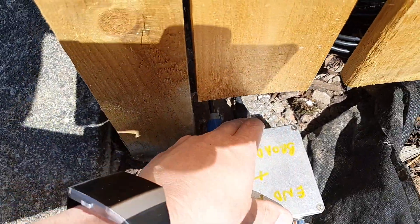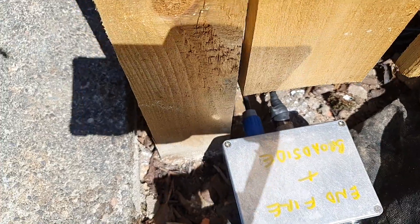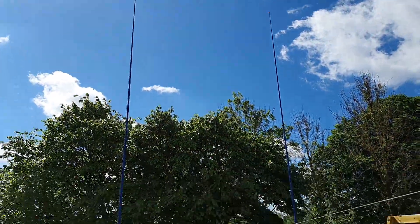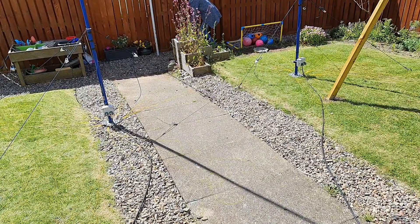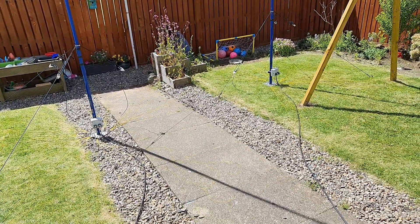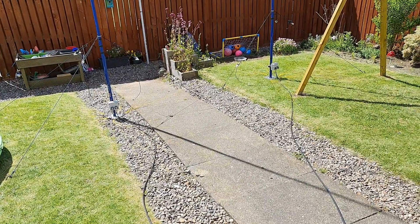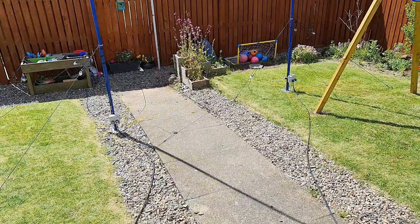The side that is delayed is the side where you actually get gain. This is the connection back to the transceiver — just a 3 quarter-wave cable that runs back into the shack. These antennas are orientated almost exactly east to west, so for some stations like Spain, Portugal, and England, I probably won't see much front to back. But stations further around eastern Europe and the States should show some front to back. I actually had these set up last night and was seeing very little front to back, but that's just to do with conditions — the front to back has actually been a lot better this morning.